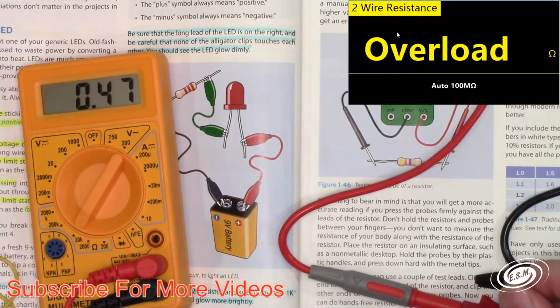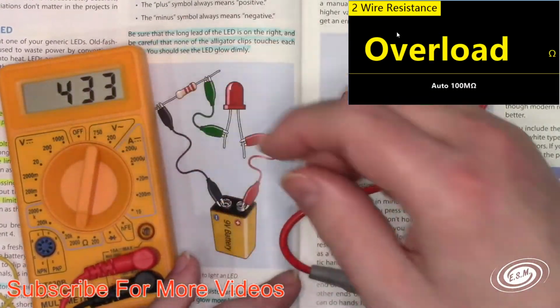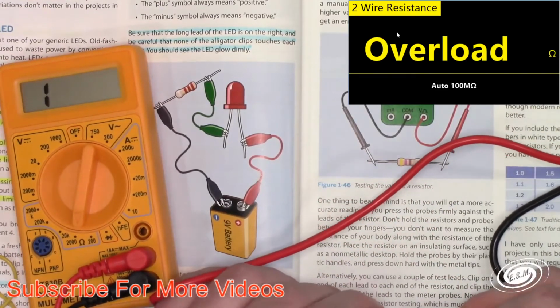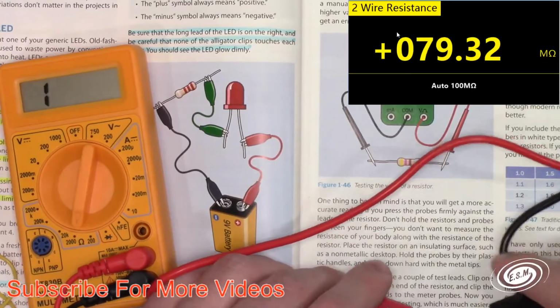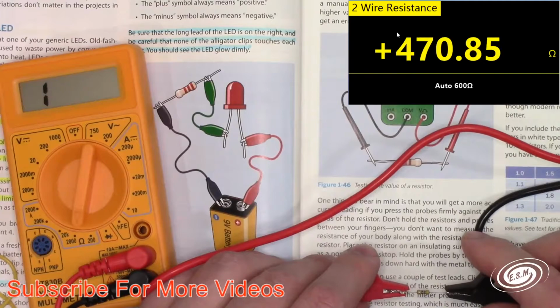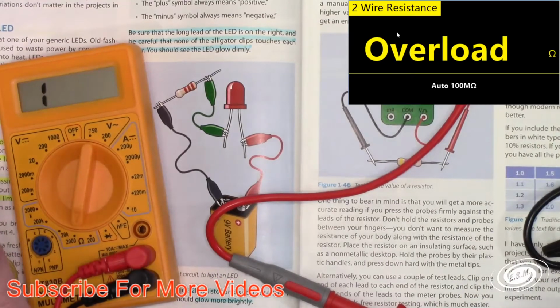I'm getting like 4.47. Oh wait, I'm on the K range. Let's go down to this range. This looks like 472 ohms. So this is the 470 ohm resistor. That's pretty close, 472. And let's check it on this one just so we can prove that my meter's not worth the money. Okay, so 470. This is like spot on. Wow, this is well within tolerance. So, alright, we've learned the value of resistors.